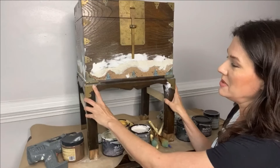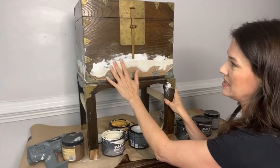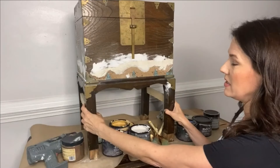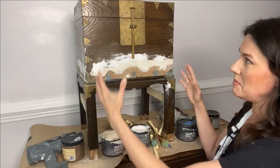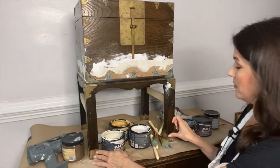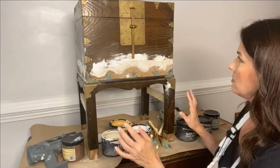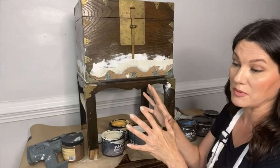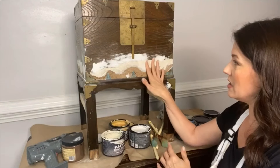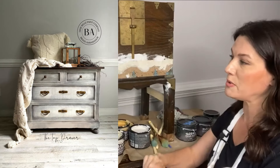It is missing some little nails which I will add when I'm done, and it had a whole bunch of veneer damage that I picked off, filled in with Dixie Belle's mud, and sanded back to flat. I added two braces on the sides for support because the legs were a little wobbly — the joints just couldn't be secured anymore. It's also missing some pieces on the bottom of the feet; there used to be probably some brass feet down there. So we're working with what we got.